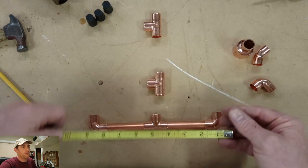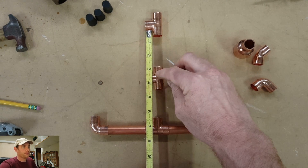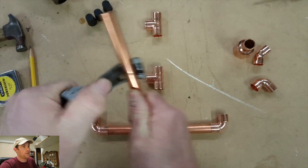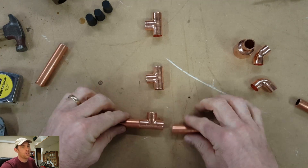Here I'm cutting the pieces between the joints and it's all guesswork. I'm going to try to make the length the same as the width but it's really rough. I cut everything with a pipe cutter because it compresses the ends so they'll slip in the fittings a little easier. If you use a hacksaw there's burrs and stuff — it's not worth doing. If that's all you got it'll work, but you're going to have to clean the burrs off.